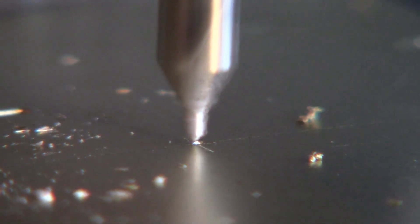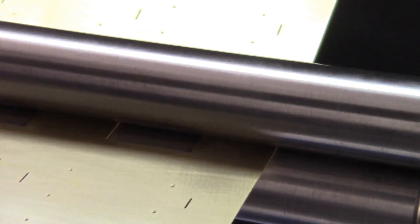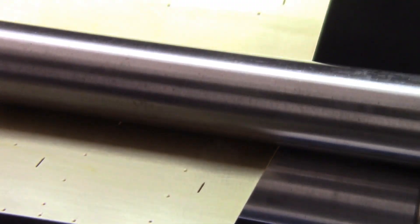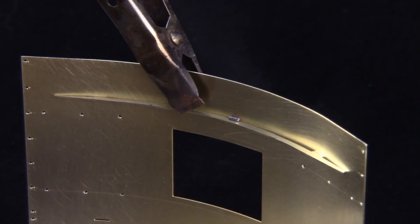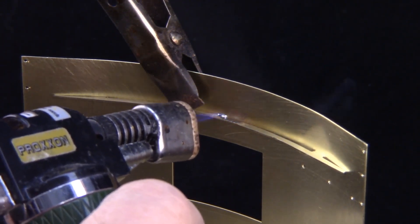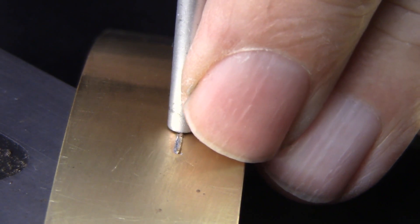Therefore, there is a number of additional screwings that all are done with the relatively small M0.6 screws. The curvature of the roof can easily be achieved using the bending machine. I adapted the originally more massive brass ribs of the live steam model to the profile of the wooden construction. They get soldered and the fitting rods get bolted.